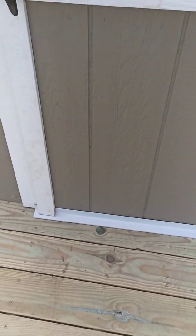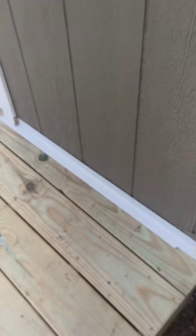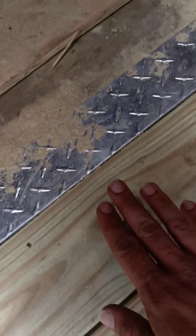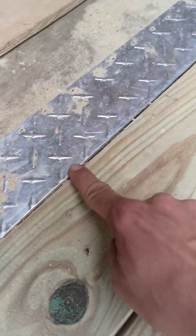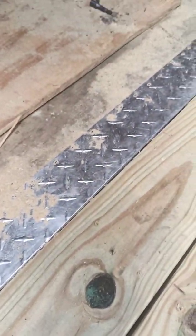Other than that, we got the drip edge that I'm working on. I'm not going to show you that finished, but this is the gist of what's going on. I cut the door base here so that where we meet up here on the inside is flush. I don't like that hump that I see people do. I did a 12-degree cut here, 12-degree cut down there on the side, 12 degrees off of the ledger board, 12-degree off the top of that 2x4. That's the kick plate for that. So everything had 12-degree cuts to end up lining this up perfectly.